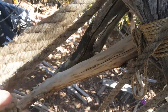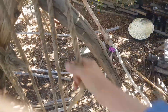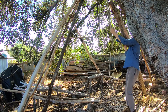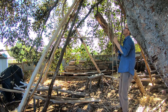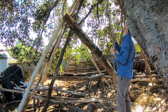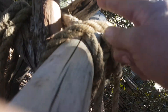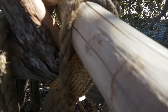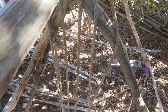What I've done here is I've got a loop going down there, so I'll put one end of the log through that, and I've got another loop over here, and I'll put the other end of the log through that. Then I'll be able to pull on these ropes to raise the log. I've made sure it's coming across the ridge beam from this side and across the ridge beam on this side, so the rope doesn't get jammed in the cracks. I'll still be able to make adjustments and get the cross beam in exactly the right position and hold it there so I can mark out the joints.